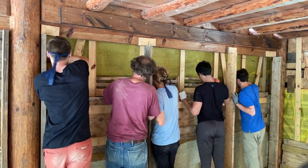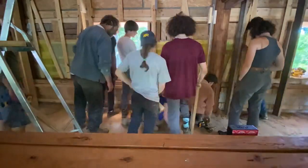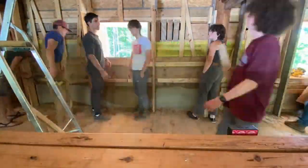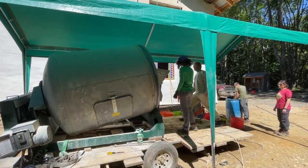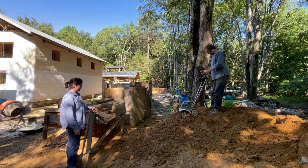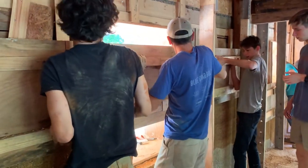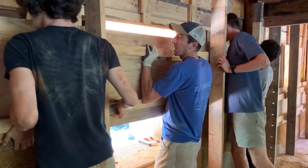They managed to finish — we're at the end of the second week right now, and they finished the entire west wall all the way up on the inside. They are mostly done with the north wall, and there's just pretty much the east wall, which is one of the smaller walls left. So we're actually almost done with hempcrete. And we've been using a new mixture that uses some kind of fancy French lime, and also there's clay added, so it's a different color, but it works a lot better than the old one. It's a lot harder immediately, and it doesn't have as many pieces flaking off.